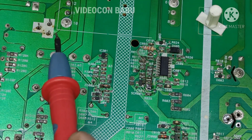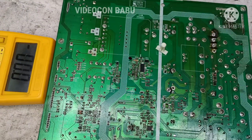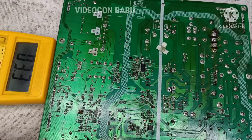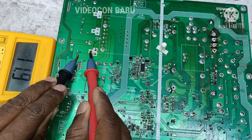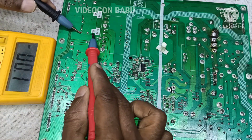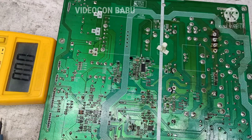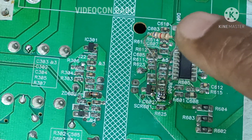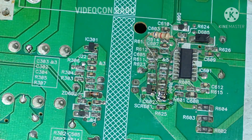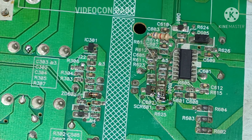The LLC output is 11.9 volts, and 24 volts for the backlight. By altering the grounding resistance value to 6.8K, I increased the input sensor reference voltage. This is the method to operate the LLC without the PFC circuit. Thank you.